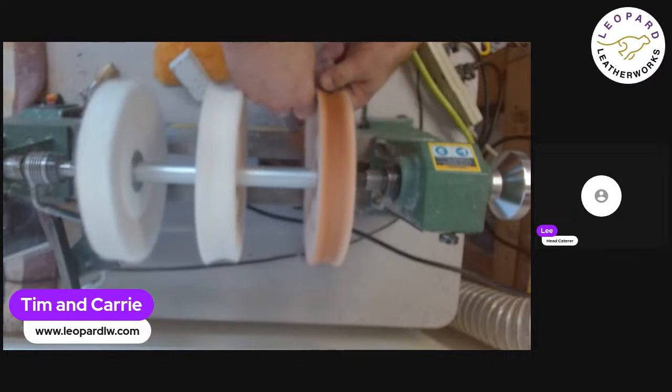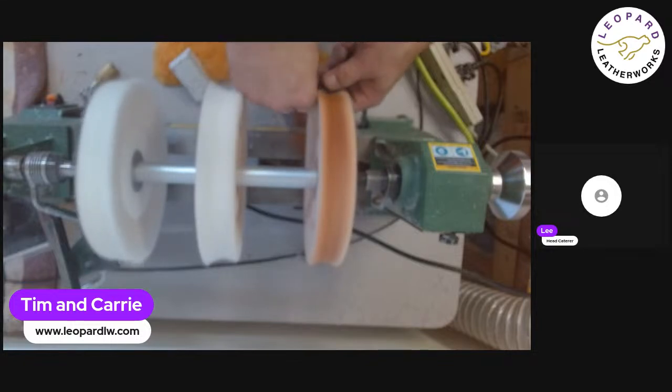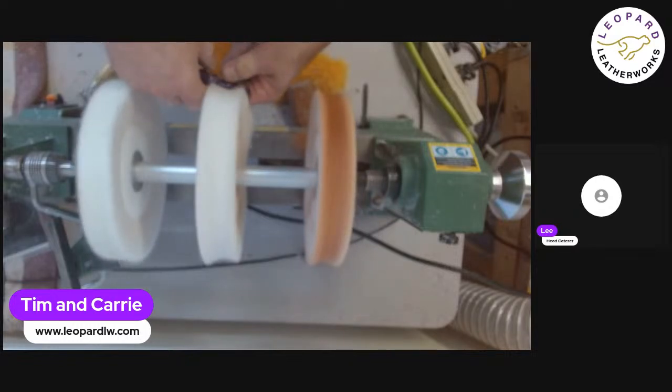So again, now that I'm over the buffer to further explain the new finishing thing we're doing here, I get to hold this pen at a 45-degree angle against a very fine polish. So it actually smooths out, never removes them completely, but smooths out any lines that were left over from turning the pen and sanding it and finishing. And then this is an even higher level polish, which doesn't change anything, but just polishes it up to a shininess. So we really wanted to keep the satin finish, didn't want to change anything, but wanted to make it a bit shinier because everybody wants shiny.